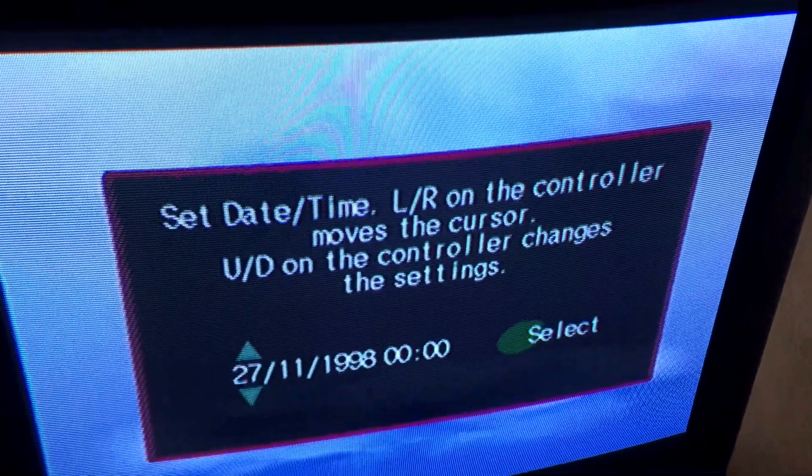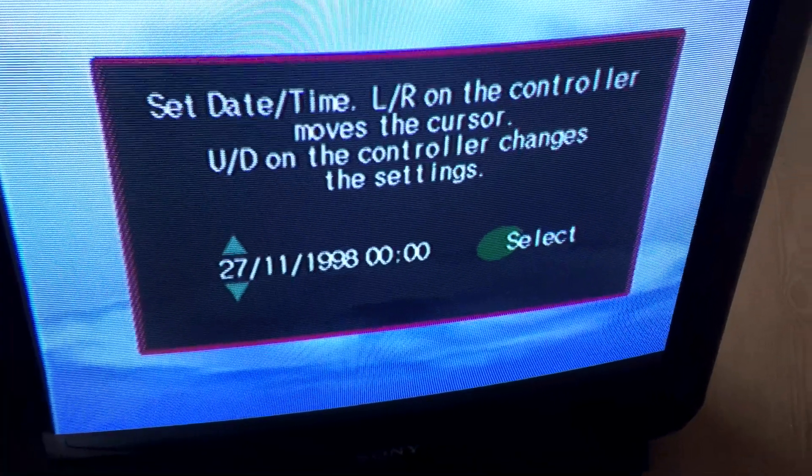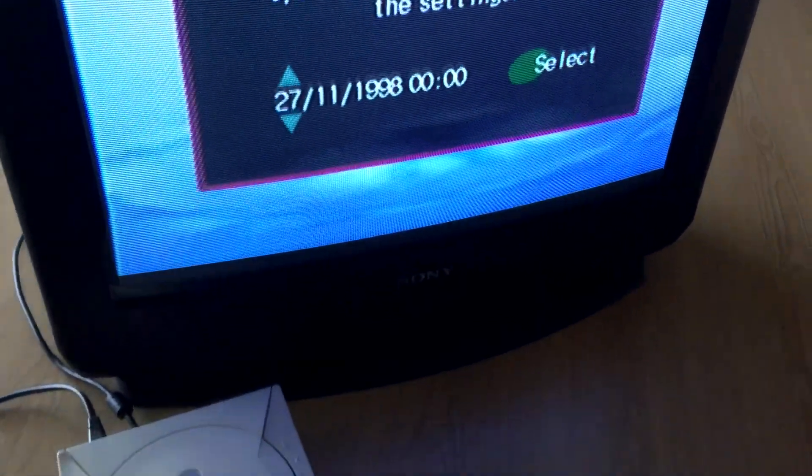Firing up the TV, I got just a black screen. I was getting audio, but no picture. Removing my 5V blanking input gave me a composite image just fine, but when I reapplied it, the screen would go to black.